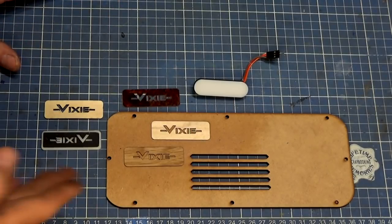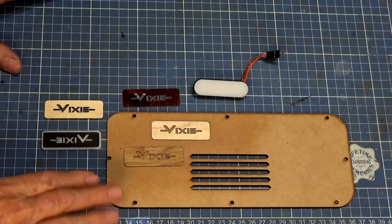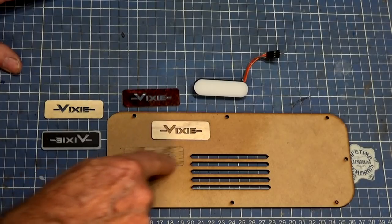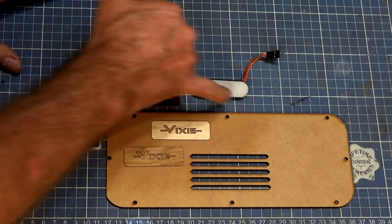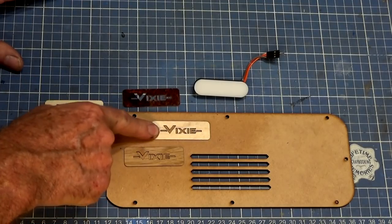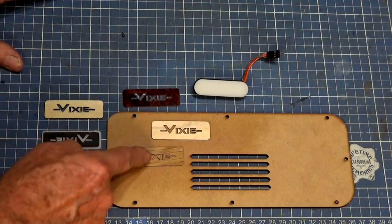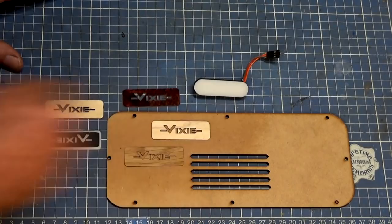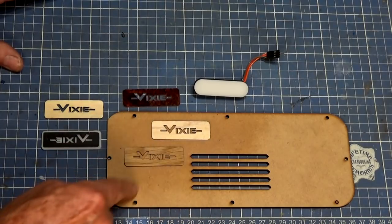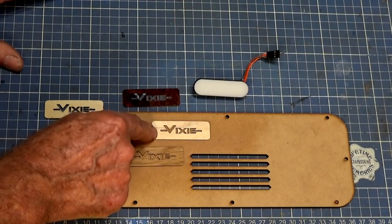Well, I don't know if you can tell, but I've been doing my research and development on this technique. And these are lots of examples of what I've been trying. And my main issue is getting this very thin mask to be able to adhere to the acrylic front panel. And this is probably one of my early attempts, and I figured that I could glue this down with epoxy or with a PVA of some sort. And that worked fine on MDF. But it was never going to work on acrylic. And even though you'd say epoxy will work, it's going to ooze out into the little pockets through the front of that mask there.